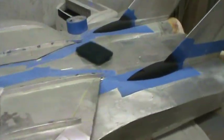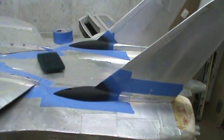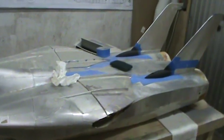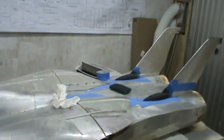Later tonight I'm going to start doing the detail work — the panel lines and screw detail on these two fairings — so I can get the vertical fins ready to start molding later this week. Hopefully my brushes get here Tuesday or Wednesday. So getting closer. These flap parting plane boards — this one's like 6 inches by 40 inches, about $6 for a board. One board will do one flap, and I'll just recycle that board for the other flap. Hopefully I'll have enough material and epoxy to get those two vertical fins done, the flaps and wings done, and these other molds done.